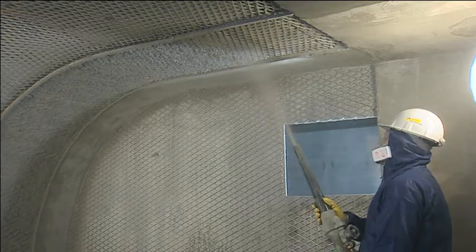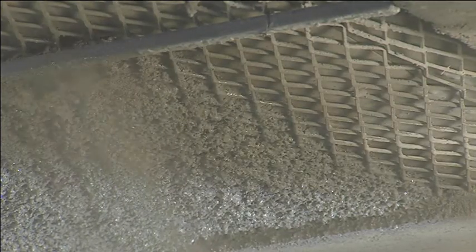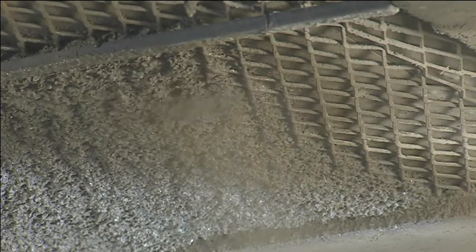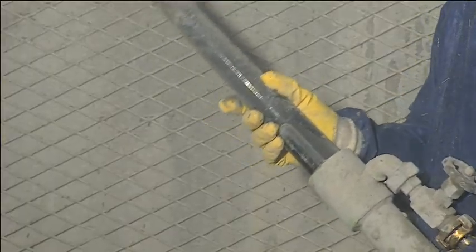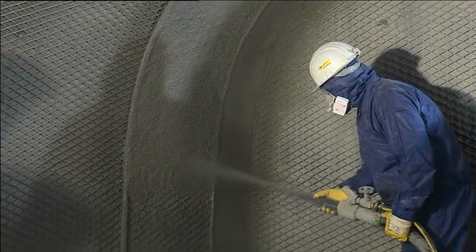Spraying of Kalcret requires the installation of a suitable wire mesh as well. The distance between the spraying machine and spray nozzle may be more than 100 meters horizontally and more than 40 meters vertically. Advantage: in most cases, feeding of the mixing vessel with Kalcret is easily done on a floor with convenient material supply, even if the surface to be lined features poor accessibility.